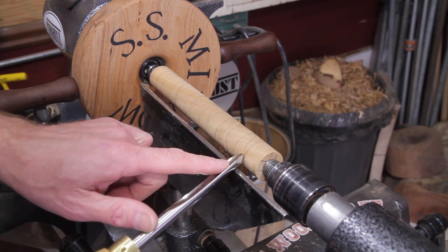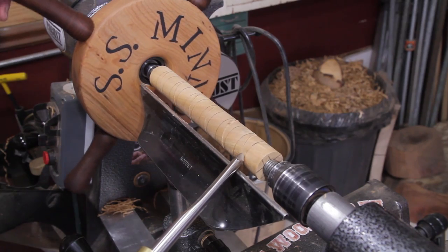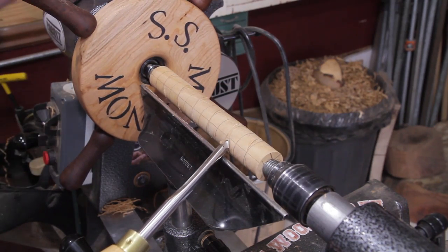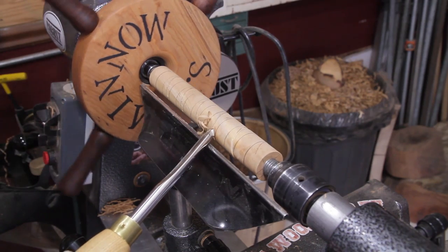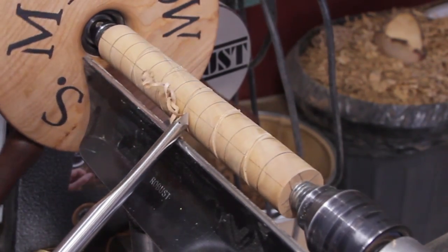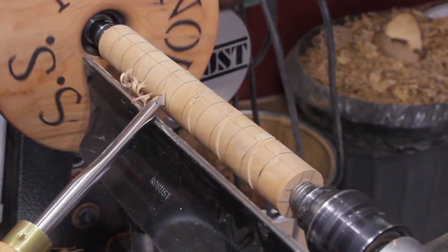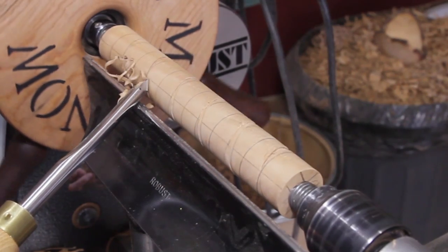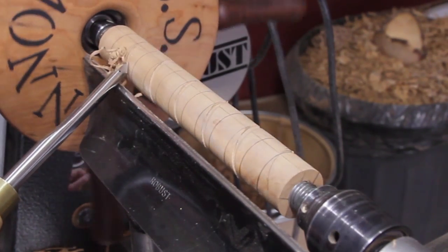Now that you have your saw mark in there and your tools are nice and sharp, go ahead and run along the bottom side right along that curve line. We're going to carve out quite a bit of material. It doesn't have to be perfect, but the curve mark really helps guide the tool. The handle I made really helps — when Robin was painting this one last week it was a pain reaching around the lathe and turning the piece while holding the chisel on track. I don't have woodworking chisels; I'm just using a spindle gouge. I think wood-carving chisels would actually be better for this.